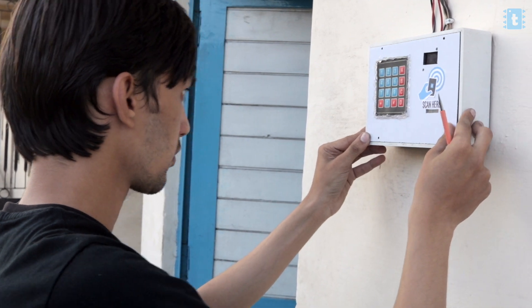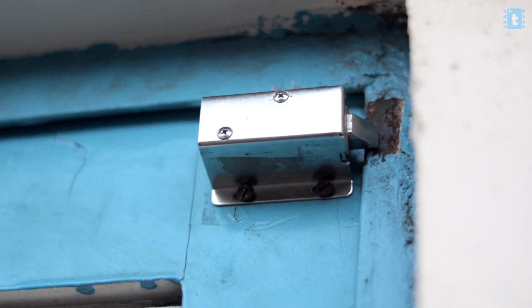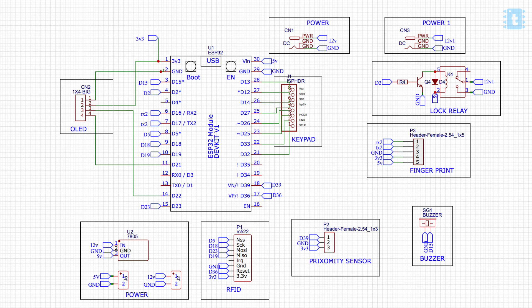Everything seems to be installed properly. Now before I show you the working of the project, the project didn't work at once and the problem was a lack of power. What was happening is we were providing only a single power supply to the whole project. At the time the door opens up, the solenoid lock sucks up a lot of power, and due to that the ESP32 board was not getting sufficient power and it kept resetting every time the door opened up. So what we did is we provided separate power supplies to both the solenoid lock and the ESP32 board, and the schematic changes accordingly. When we tried with this connection, the project worked.